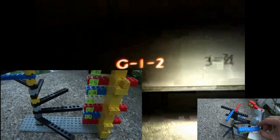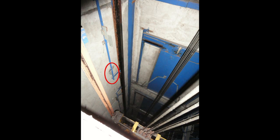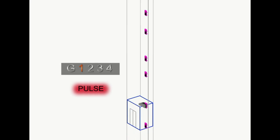Now I will show you what triggers this carriage floor selector. In the lift shaft are these plates — there are two. Each is read by a separate device on top of the lift car. When the device reads both of these plates at the same time, on the overlap, this is probably the stopping position of the lift on the particular floor. These are found at every level in the lift shaft. The device on top of the lift car is called an inductor. Each time it reads a plate, it either turns off the current floor or turns on the next one.